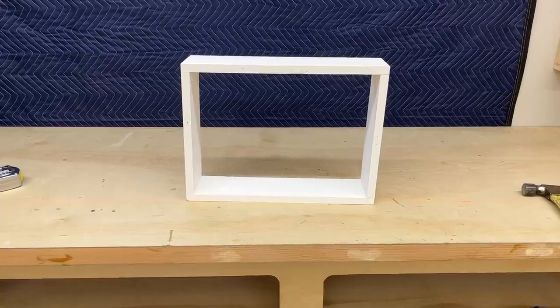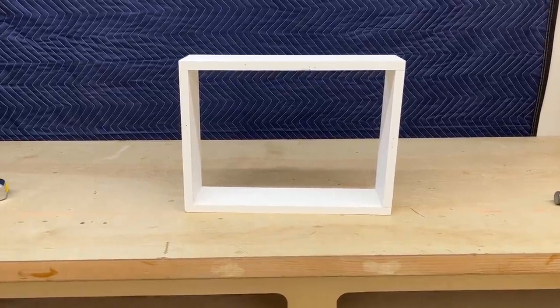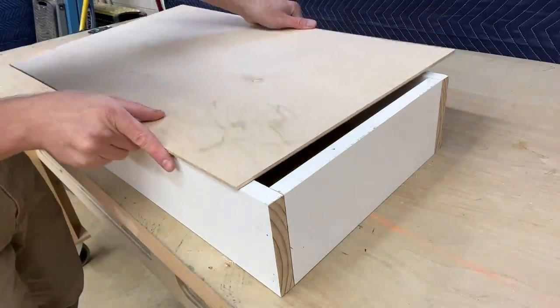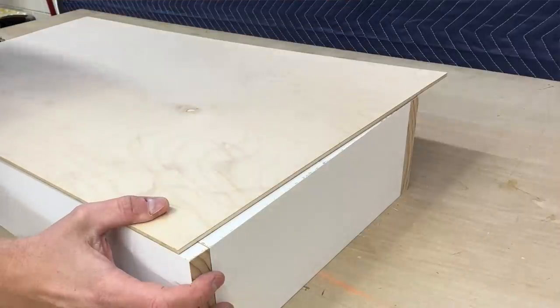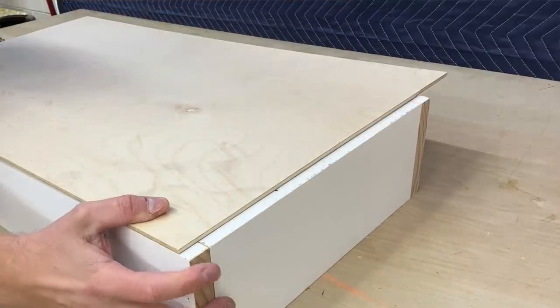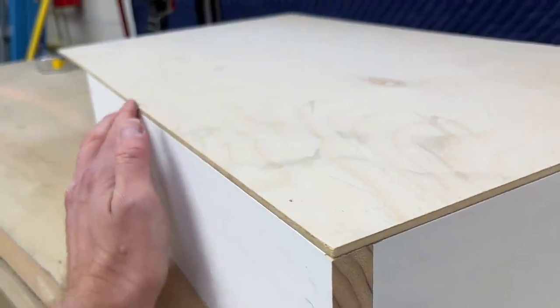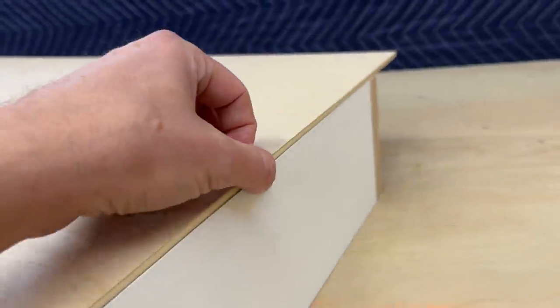Sometimes here in the shop I'll use factory edges to quickly square up cabinets and boxes. Here's a little box I made last week. I could square it up by pulling diagonals, but if I'm going to put a back on it I'll just be sure to use a ply piece with a factory corner. Then I can simply use that ply piece as a sight line that tells me when my boards are pulled into square. I've used versions of this technique numerous times in dozens of applications — sometimes a factory corner is just another way to corroborate if something is square, or it can be your whole method for squaring up a box or even a small floor.